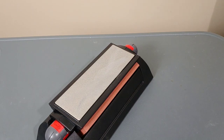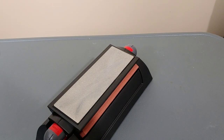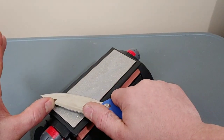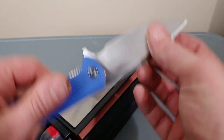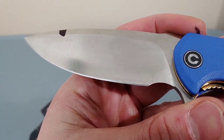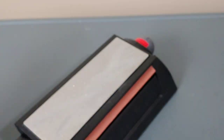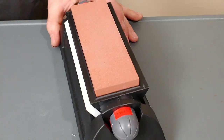Look at it — very cool. Even though my burr is all the way over, I can tell my bevel just needs a couple more passes. That feels good — let's look at both sides. It looks fantastic. The grip pattern is going the same direction, the bevel looks nice and even from heel to toe. Let's flip the stone to the aluminum oxide — I'll try to use it dry for a second and then I'm going to switch directions.